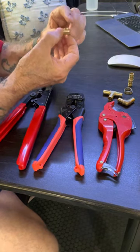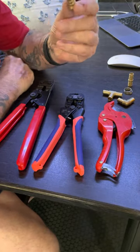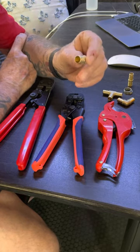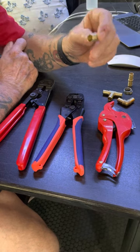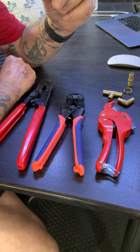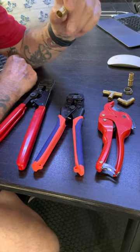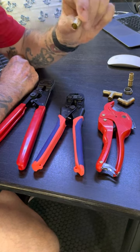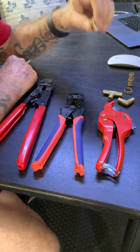This is a handy little part that I stumbled across one day buying supplies at the local hardware store. It's a plug — all it does is cap off a piece of PEX line. If you don't have the right fitting, or if you're trying to make an emergency repair at the campsite and can't get to the local hardware store, cut the line, plug this in there and crimp it, and you can at least finish your camping trip.